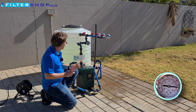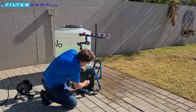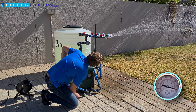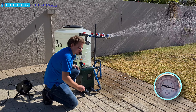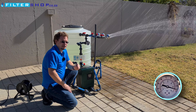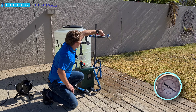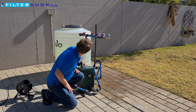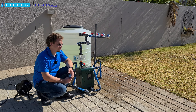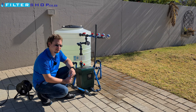Let's see if it can even run a single shower without going over power at 5 bar. At 5 bar with a single shower, it's overshooting to about 5.5 bar. At 5 bar we're at the limit — 800 watts — and if it goes to 810 watts it starts flashing warning lights. It can do the high pressures, but then you lose all the benefits of the variable speed drive. This pump is a little bit too small for that.